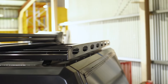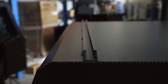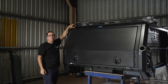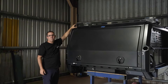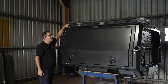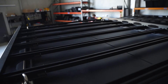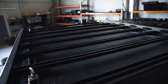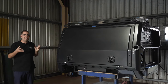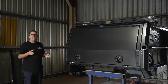You'll notice at the top here, this is actually one of our roof platforms. All the canopies are made with a channel across the roof — they run two channels north-south and then you've got a few different methods. You can bolt rooftop tents directly to those rails, or you can run platform racks or crossbars as we call them. What makes the platform rack a little bit different is each section has an east-west cross brace which actually has Unistrut. So if you're carrying ladders and all different types of things on your roof, you can actually set strapping points up to suit the equipment you're actually carrying.